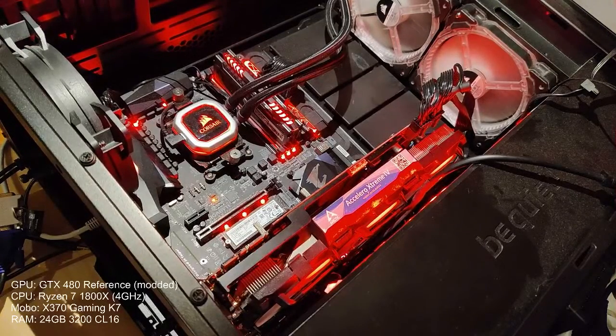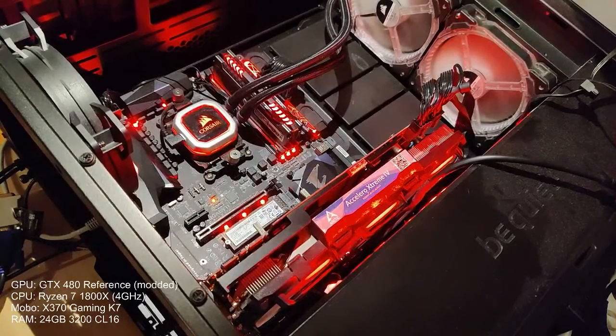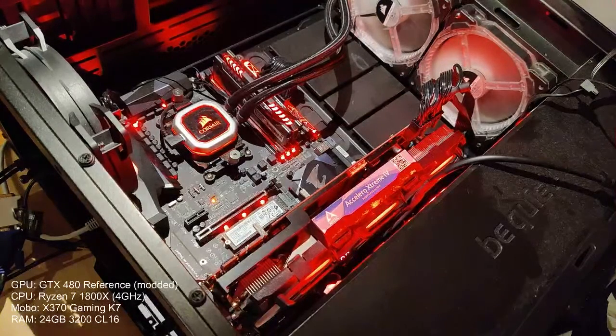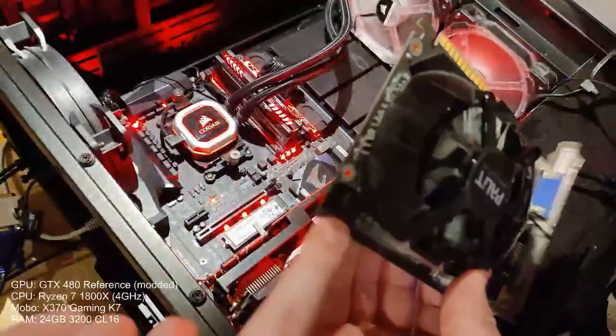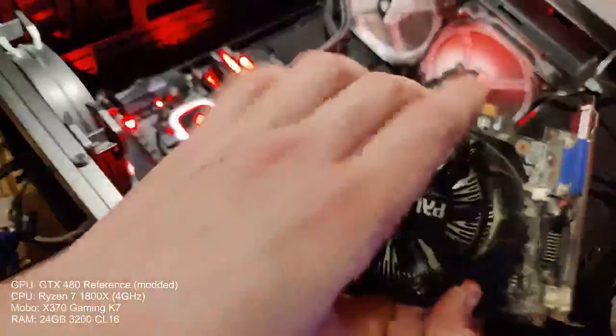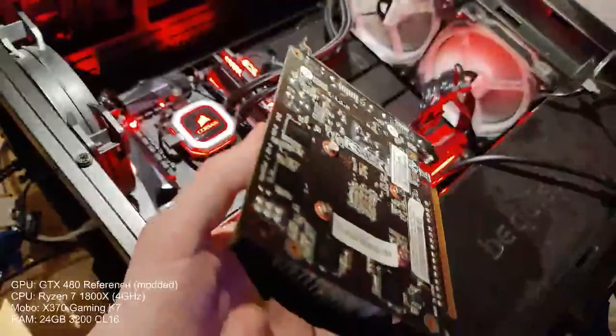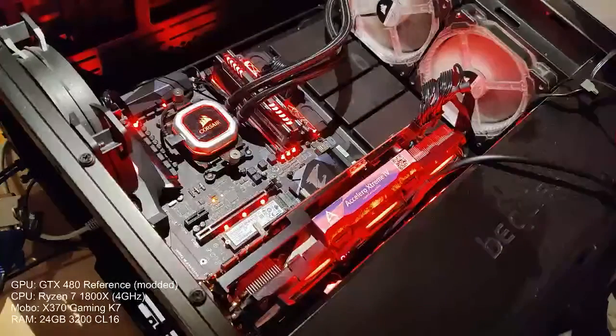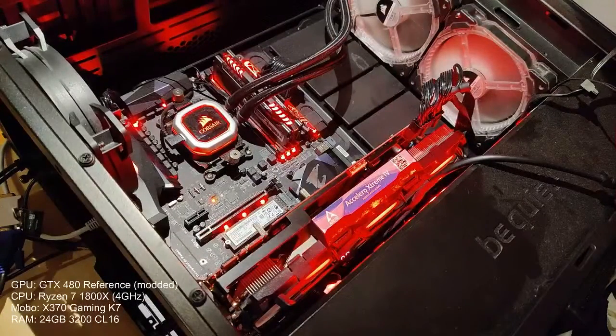Yeah, you can add it to 75-watt GPUs. Sometimes the cards already have solder points for that. I'm gonna take an example. This GTX 650 of mine has a connector right here. And there's a 750 that uses this exact PCB, but it does not have that connector. But it still has those solder points for the connector. So it's really easy adding a connector to that card.